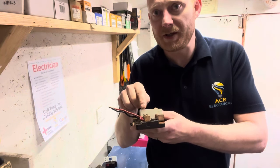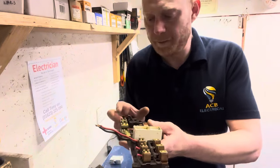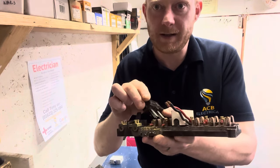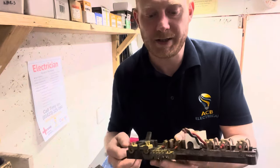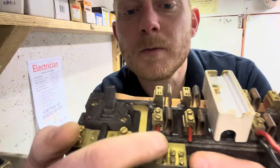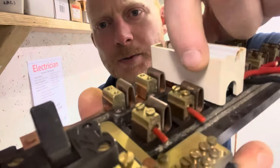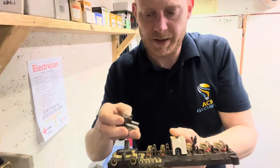While we're on the subject of these, if you do need to replace the fuse, only ever replace it with the correct rating and the correct size for the circuit. And if your fuse does blow, switch the switch off before you put the fuse in or pull the fuse out. The reason is arcing — if you connect it like that, it's going to flash an arc. If there's still a fault on the circuit and you push that in, it's going to bang right in your face. You can see in there the witness marks where these have been pushed in and pulled out while live.